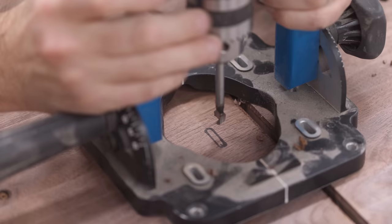After a lot of sanding I glued the door pull onto the first strip of tambour and had no idea I was completely overlooking something right there — can you guess what it is? I added a round over to the top of the monitor riser and realized I had a little divot that needed filling. I knew it wasn't deep enough for the polymer to stick, so I chiseled it out a little deeper before filling it with the knot-filling polymer. Right away I hated this — it looked like a big black stain on top, but I'll come back later and address that.